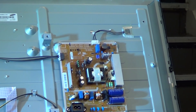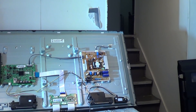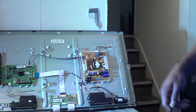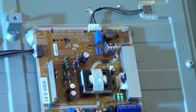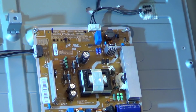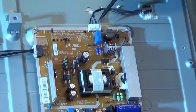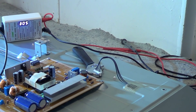The first thing I'm going to check: as you can see, this is our power supply board to the right and this is our LED connector from the power supply going into the television — that's for the LEDs. This is fairly simple. You can read the little legend next to it. The black wires are always negative and the gray wire is positive. We're going to check it with our LED checker — I'm pretty sure one of these is wide open. We have gray-black, gray-black, and gray-black — three sets for three LED strips.